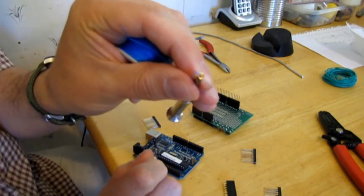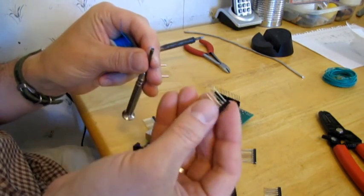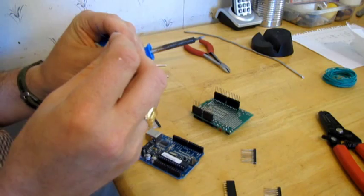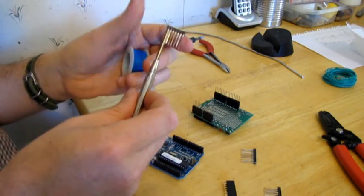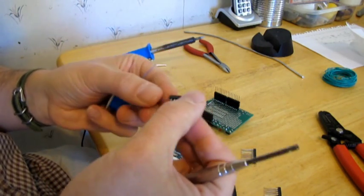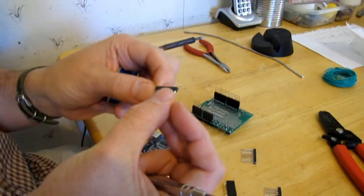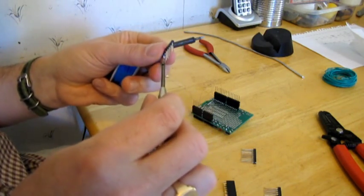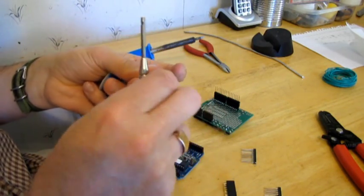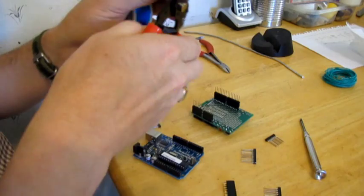Then there's a very small hole that you put the pins into. You have these little sockets that have long square legs on them. You put that into the hole, and if you twirl that, you now get a very strong and very capable connection there without having to solder. And it can be undone very quickly too with the wire wrap tool. There you go. It's a very nice, easy way to make connections, what I would call maybe one step up from using a breadboard.